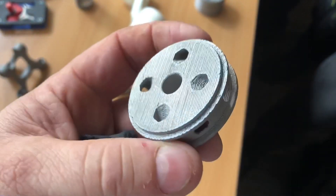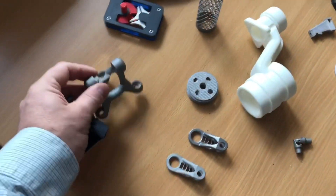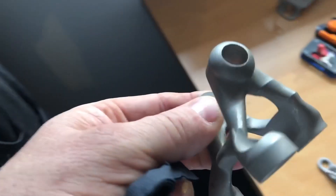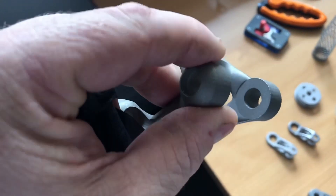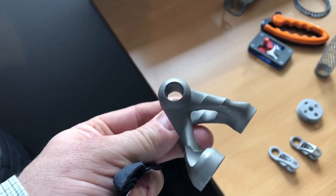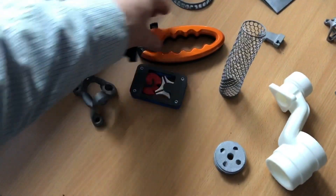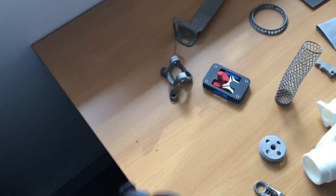So this is a part that's been printed pre-machined with all the holes you would post-process if you needed a machine dimension, but this is a pretty good start point. If you were to compare this to say a cast part that would then also have finishing — pretty crazy. The 3D printing materials include some nylons and some carbon nylons.